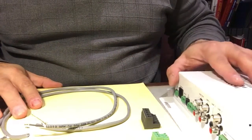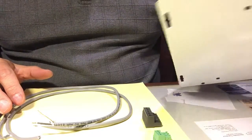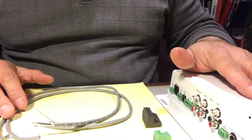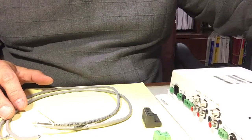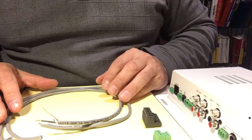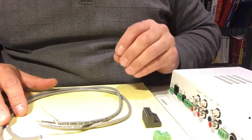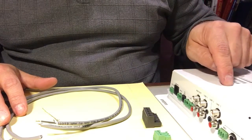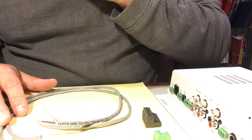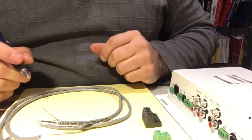Hello, let's make a little introductory video on how to install the CA amplifier, the compact amplifier from Eclair, and combine this with the RDL headphone amplifiers as well as an RDL FP-MX4 microphone mixer. So the purpose is to take the output of the RDL microphone mixer, send one of the outputs of the mixer to the amplifier so we can power the speaker, and take the other output of the mixer and send that to the RDL headphone amplifiers so that we can have listening stations.